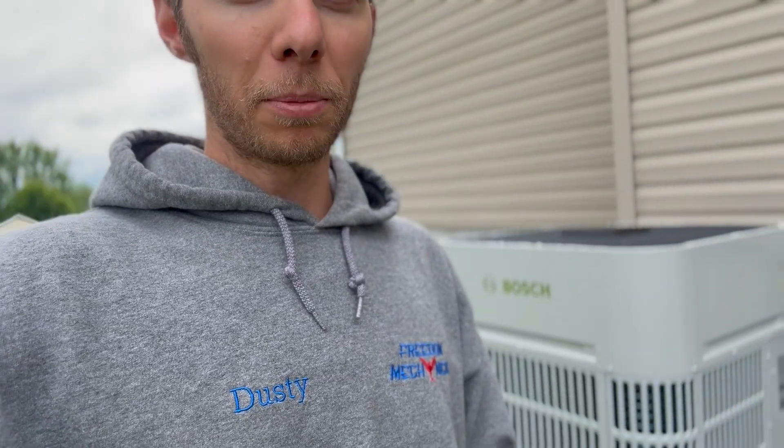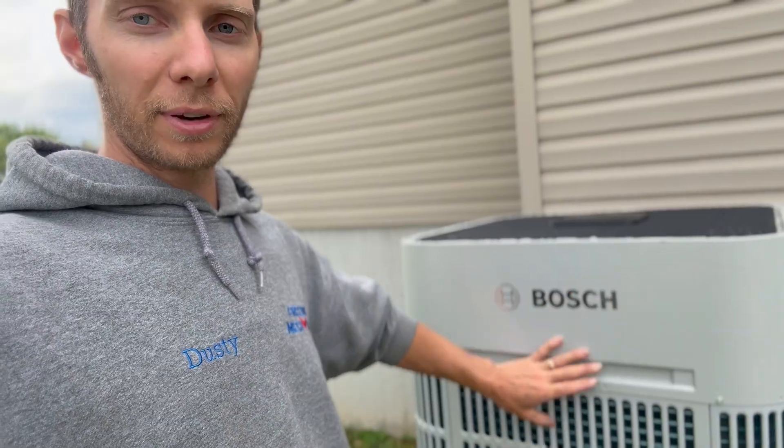One main reason you'd want to go with the Bosch Ultra is because this unit has a projected output of around 55,000 BTUs at zero to five degrees — that's its rated capacity at zero to five degrees. It's just unreal the amount of BTUs you're going to get at that low a temperature. This unit is capable down to negative 13°F, so you're going to be able to use this much more compared to even the entry-level Bosch that stops at five degrees — a much more capable and efficient unit. The outdoor unit has a higher fan center, so now we can utilize the top portion of the coil much more efficiently. They've redesigned quite a few things here to make this the most efficient model yet.